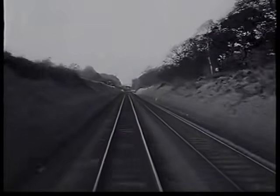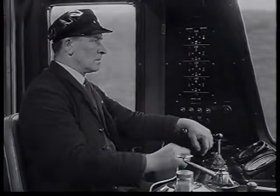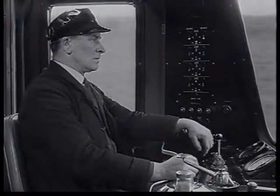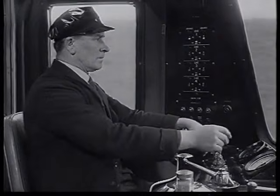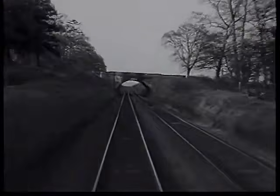It is important to remember that diesel trains run very quietly. A two-tone horn is fitted, both tones of which should be used for a warning, one after the other, to avoid the sound being confused with the horn of a car. A single note must be used for routing or other codes.